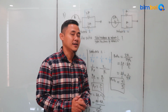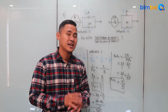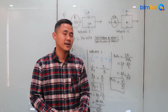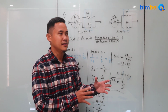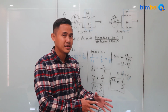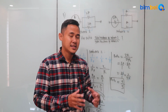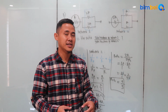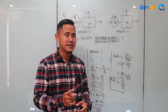And lastly, electric power is the amount of energy flowing per unit time. In this case, we describe power in units of watts. The definition of a watt is joule per second. It describes the total amount of energy that is flowing through the wire per 1 second.